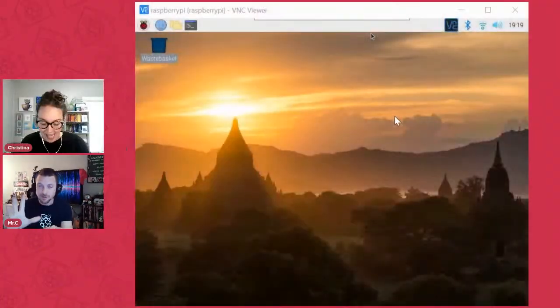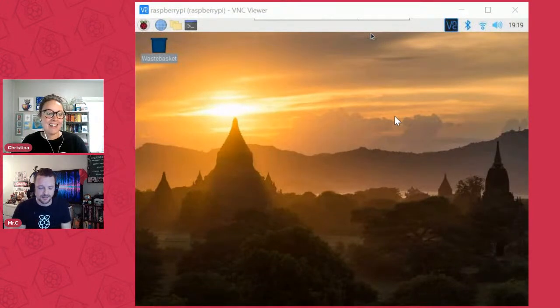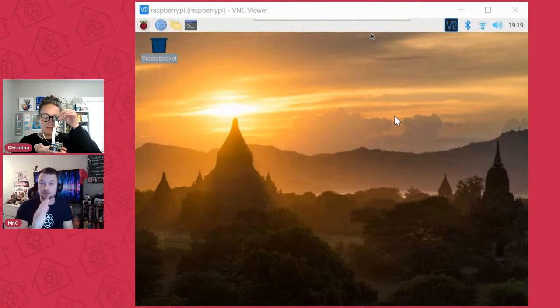Yesterday I spent about half an hour working out why my Raspberry Pi wasn't doing a thing with my camera, and it's literally because one side of that clip was not pressed down properly. It was telling me my camera wasn't working, it wasn't initiated. I fixed it, but it took me a little while. So make sure both sides of that clip are pushed down and your cable is nice and level. Check that you can see a little strip of silver bits coming out of the connector, and they should all be the same length.